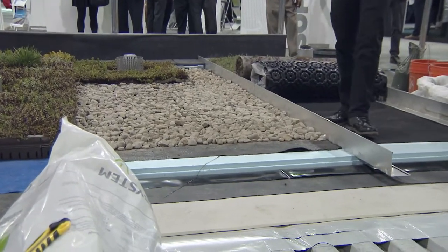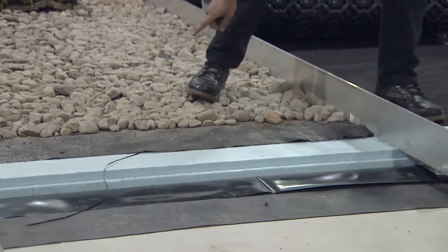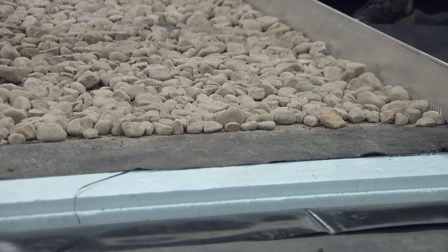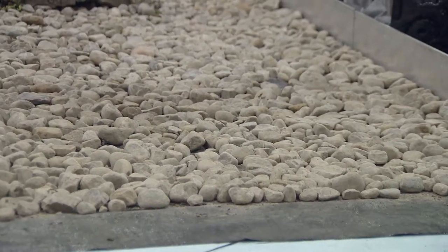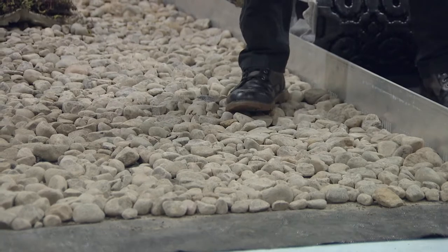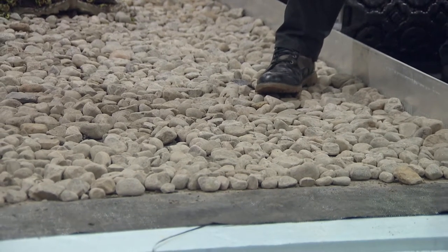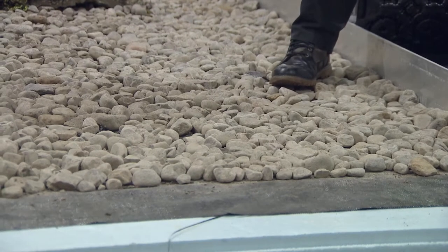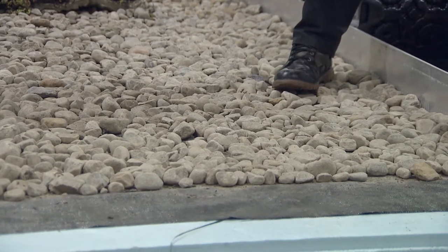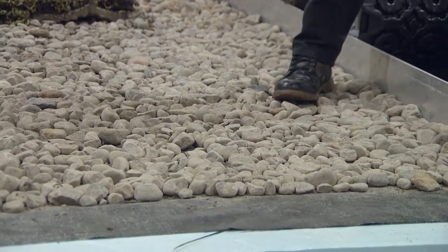After the root barrier, the roofing components are: insulation, then filter fabric, then stone ballast. In this demo, the stones have a dual function: they weigh down the insulation, and they act as the drainage layer for the vegetated roof system, providing open space for water to flow toward the roof drains. A key benefit is that once the stone ballast is installed on an inverted roof, the roofing assembly is complete and roofing contractors can walk away — the green roof doesn't have to be rushed in to weigh down the insulation, and can be installed when the weather is better or all roofing work is complete.